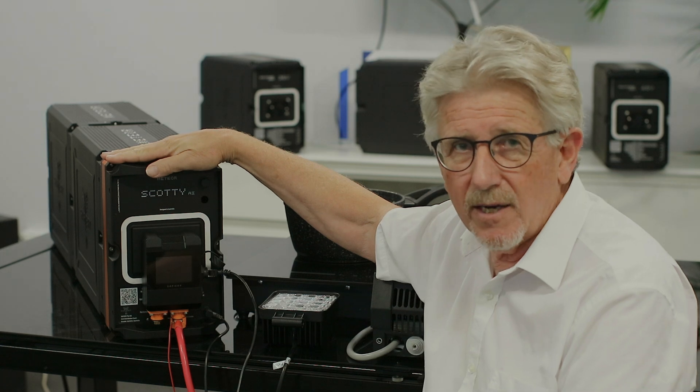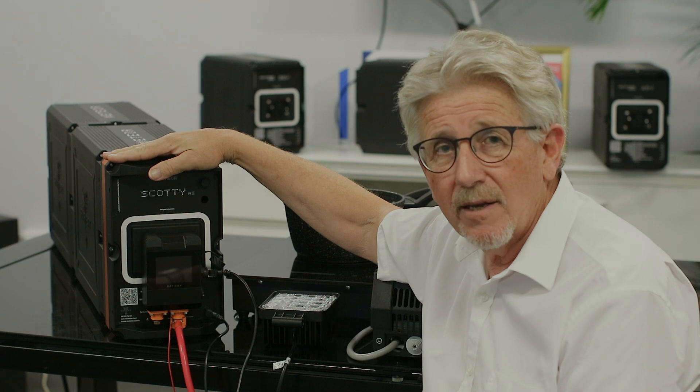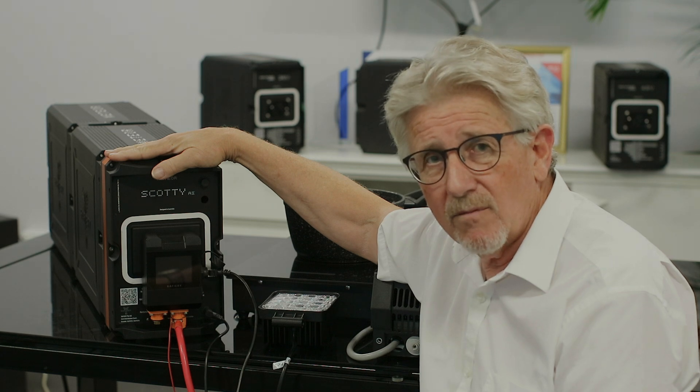It's 1500 watts of charge from the alternator when you plug the vehicle in, and it'll discharge up to 1500 watts, which is enough to run dual compressors for the air suspension in the caravan. With this setup you can really load up the 12-volt side with a high amount of power.